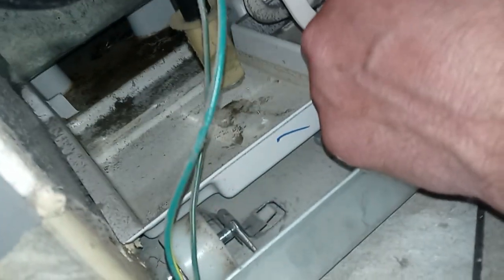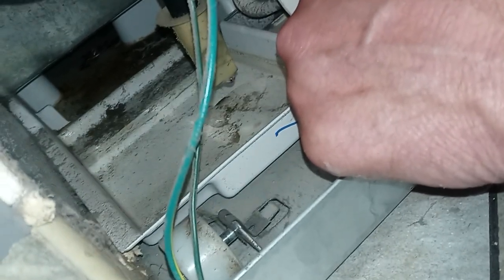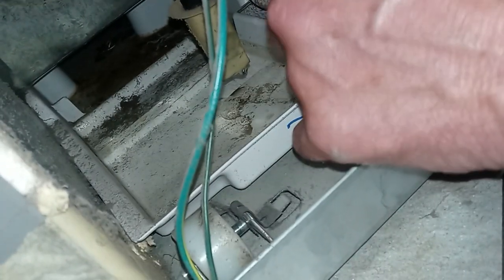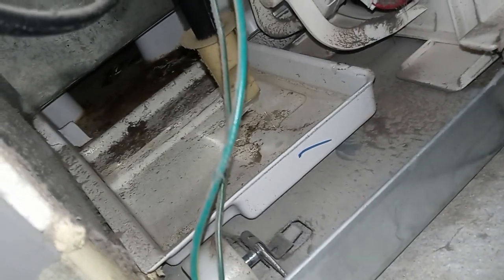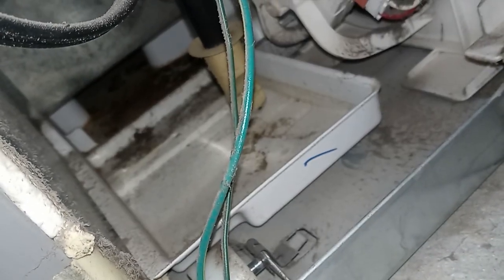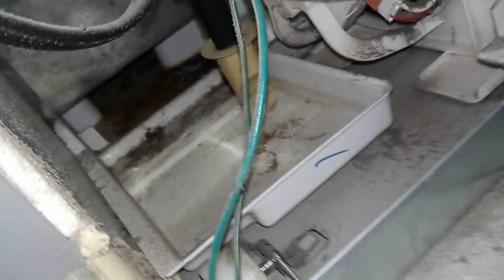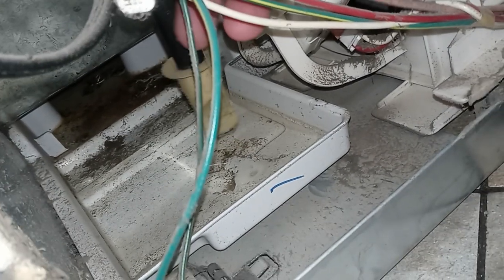So look, the hot water I put up there, this has got to be the first water that's actually drained out of that fridge in probably a year. So this is a good sign, guys. This is a good sign that we're having water dripping out. That means that we're having some progress from up above in terms of having melted the ice. So hopefully this trend continues here, and then we'll go back up top and see how the water is. But now that I'm seeing water dripping down, that's got to mean that at least part, if not the complete blockage of ice that's been in this drain tube has hopefully been alleviated by the hot water we put in.